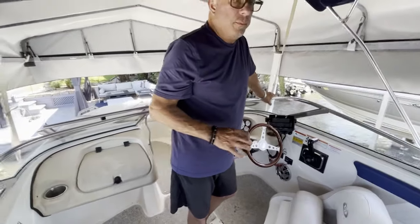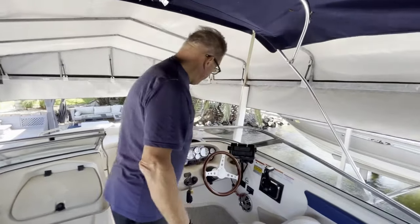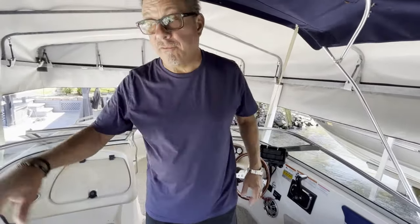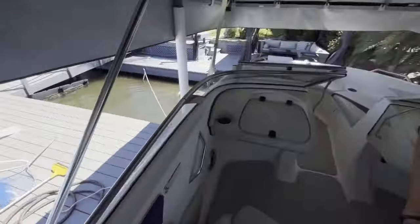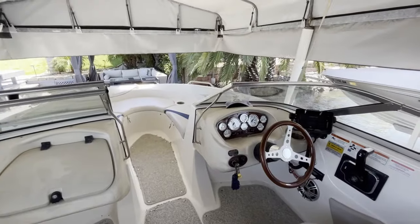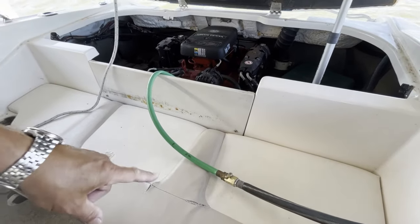The other two really important things about putting the boat to bed: you have to put the engine in an up position using this little hydraulic switch here, and you cannot leave any electronics on or the battery can go dead. Finally — and we'll get to this with the lift — all those valves down there need to be in the off position, or we can run city water into the lagoon overnight and cause a huge bill. So we are ready now to fire up the engine. Remember, with that valve closed the engine will not be getting any cooling water — it's out of the water and the hose is shut off.